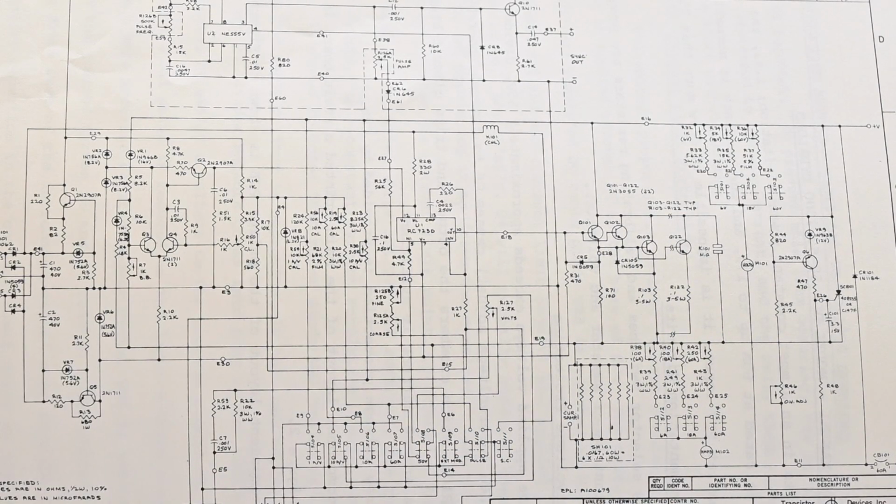I'm also going to replace all the electrolytic capacitors that are in the Dynaload. There's not that many. There's a couple on the main circuit board, and there's a handful of them over on that other circuit board with that Burr Brown 3650. That isolation amplifier, and I really don't want that isolation amplifier being fried because of a faulty capacitor in its power supply. So again, the fact that this was manufactured in the mid-1980s, these capacitors definitely should be upgraded and replaced. So I'll go ahead and do that as well. So I'll get all the components ordered up, and then I'll continue on when they're here.